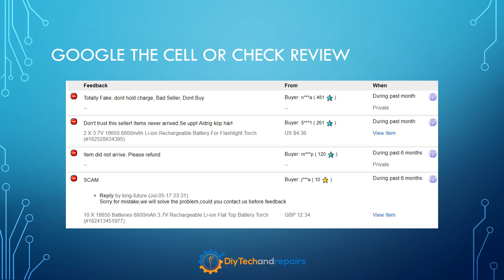Next is the fact of just googling and checking reviews of the cells. The example shown from eBay had 99.7% positive reviews, but if you start checking the negative ones you will soon find information about the cells. In some cases you find reviews stating things like 'I got 1000 mAh out of a claimed 4000 mAh.' So always look at that. Do not get fooled by reviews saying the cell works fine in a lamp — of course they will work to some degree, but they may not contain what they should. They are still fake cells.